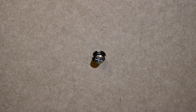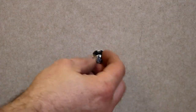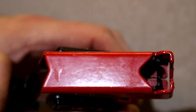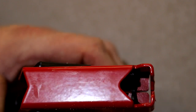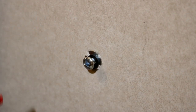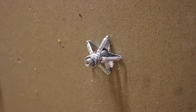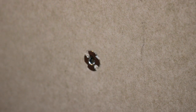Because we're not doing this with a screwdriver but with a setting tool, we can go ahead and screw in the bolt. With the setting tool it makes it slightly easier — if you were doing it by hand you'd have to put a bracket between the bolt and the anchor to stop the spin. So all we're going to do now is use the setting tool, and as you can see you have to get the bolt just past this black marker here. Both setting tools work exactly the same: you pull the trigger and it will pull out the anchor behind and set it behind the plasterboard. Screw the bolt in just enough so you can get the setting tool in there to pull out the anchor, squeeze the trigger and it should pop out the setting behind. Perfect. Now you can go ahead and remove this and pop on your shelf fixing, whatever it is you might have to hang on plasterboard.